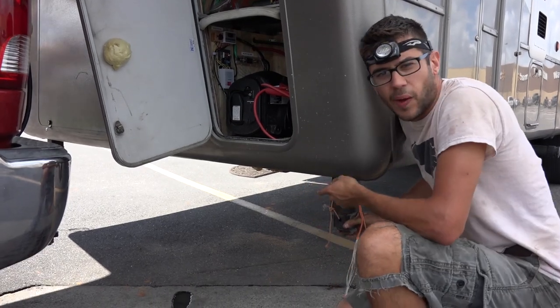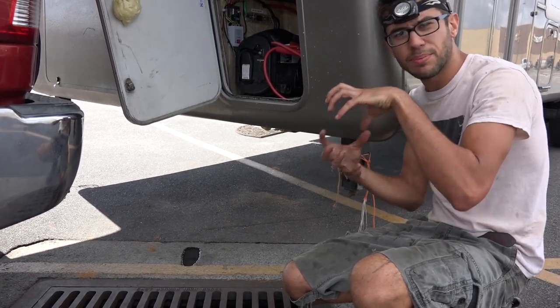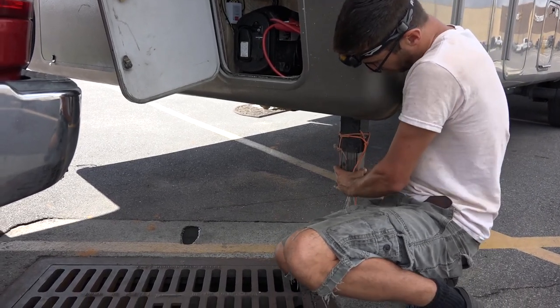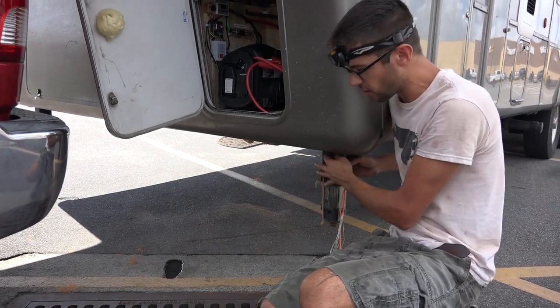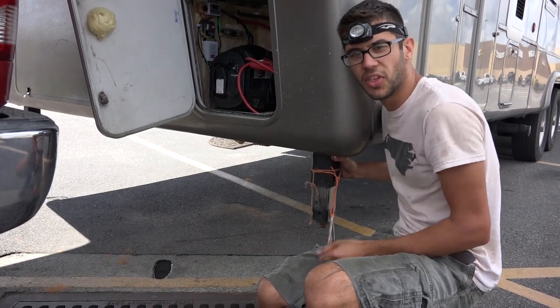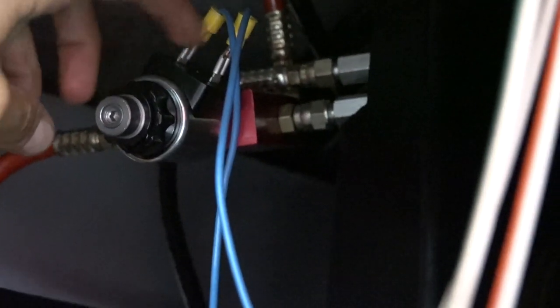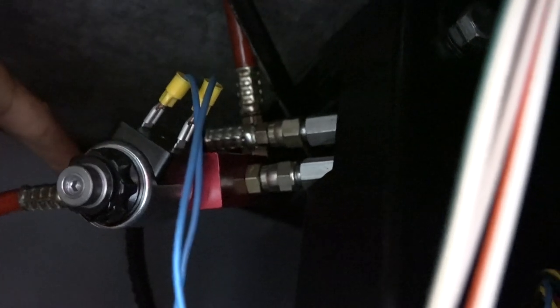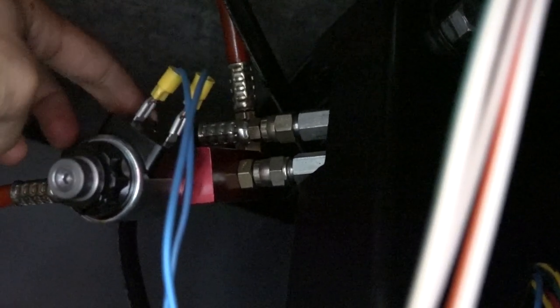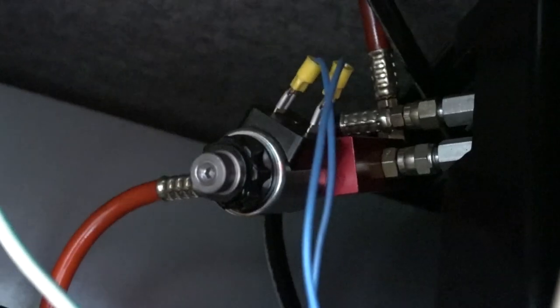We are on the other side now after a successful removal of the first side. Since we had sprayed hydraulic fluid everywhere the first time, I taped a jar to the hydraulic lines on the other side and pulled this down all the way to suck air in and force all the hydraulic fluid over to the other side. So now this one has a bunch of air at the top and shouldn't squirt hydraulic fluid everywhere. On this side we've also got the hydraulic valve — which we already replaced once trying to fix this problem — and a big red restricted valve that helps prevent the jacks from dropping too fast when released.